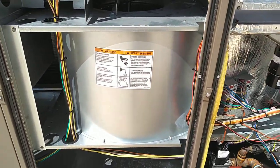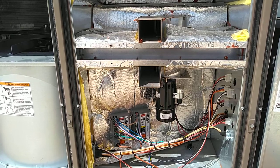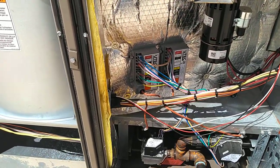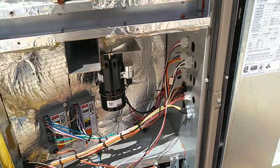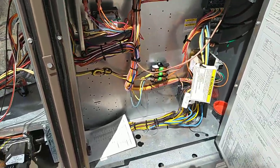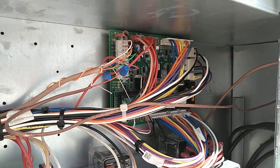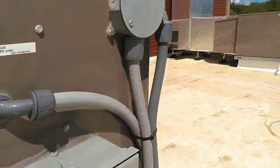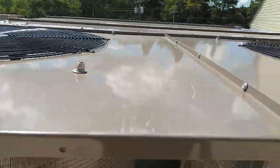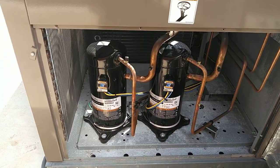This blower blows through a heat exchanger mounted behind the heating section. This heating section is two-stage. We have an inducer fan — actually two ignition modules in this unit, two separate gas valves, and two burner sections on the bottom. The control and power section are in here. What we refer to as the brains of this unit is the York Johnson Controls Simplicity Control. We also have two separate condenser coils, one for each refrigeration system, two separate condenser fans, and both compressors are mounted over here.